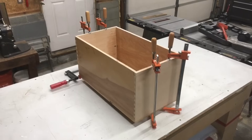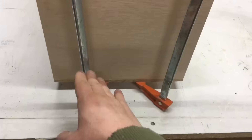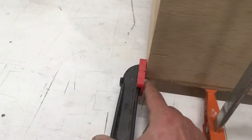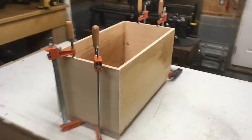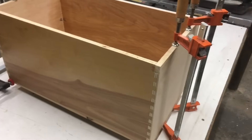It's all under glue and under the clamps. There's a little cup in this bottom piece — a little belly — so I just put a little tension on the center to get a little squeeze from the glue. Over on this side, the clamp in back — when I threw a nail in there it split, so I forced some glue in and put a clamp on that. I'm probably going to pop the clamps off pretty soon, put all the router stuff in, and put this thing to bed for tonight. Maybe tomorrow I'll sand it out — but it's just a work box, just a tool box, no big deal.